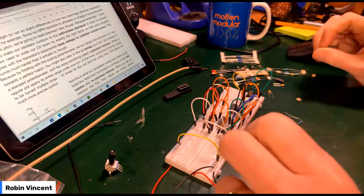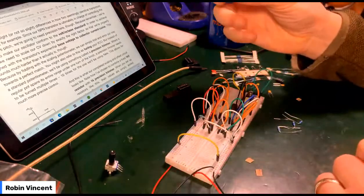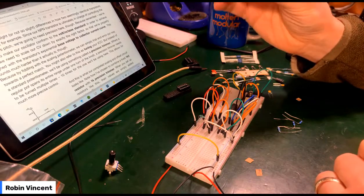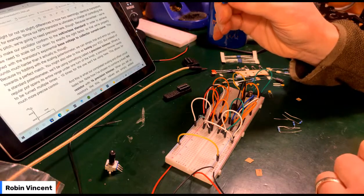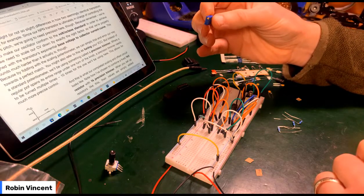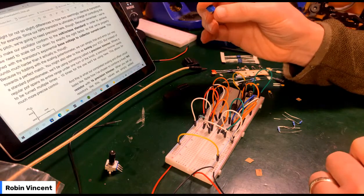Instead of using a standard potentiometer, we're going to use something called a precision trimmer. Aha! That's this fella, I bet. Where a regular pot spans its entire range under one turn of the knob, a precision trimmer needs to be turned multiple times, 10 times for the one we'll be using here. Yeah, these are weird things. You just keep on turning and wonder what on earth's going on, and then suddenly it changes something. This allows for much more precise control.